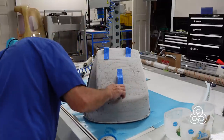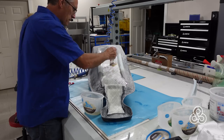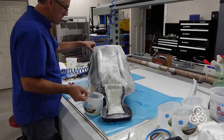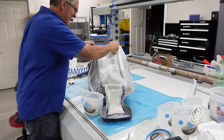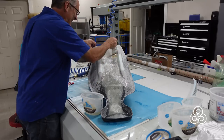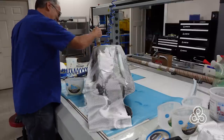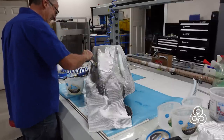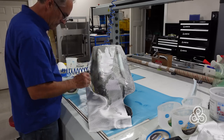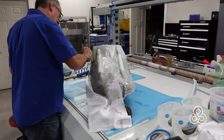We're going to put about three layers of fiberglass on here to make this a good solid structure. On the back side between those runners we're going to put some heavy unidirectional fabrics to build it up nice and thick. We want the chair stiff enough to support us but just flexible enough to bounce just a little bit, so you're not always taking so much jostle from the road. Then add fiberglass cloth layers over that — a couple of layers. Good twill fabric that conforms to all these compound surfaces, especially down into that headrest with its deep pockets.